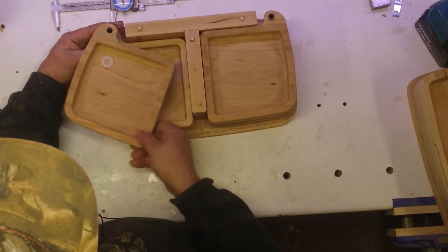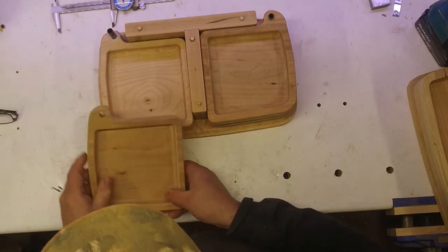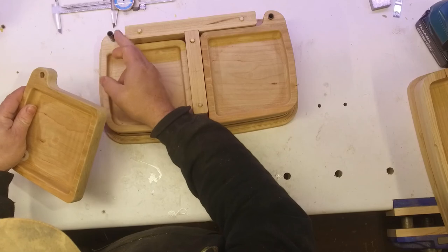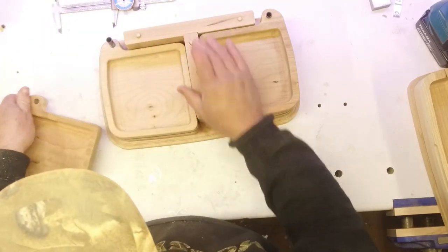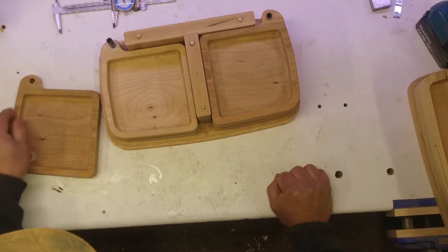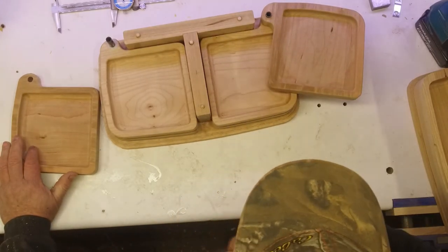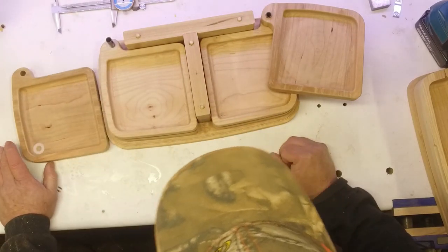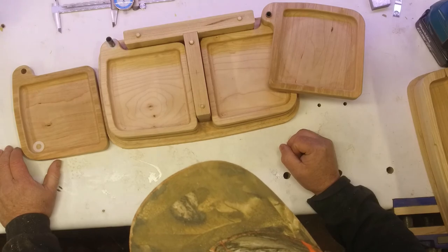I'm not going to finish and assemble everything today — it's just too cold here for shellac and everything. But as you can see, everything fits together nicely. I've got the little finger groove for the lid. I like making these — I've made three or four now, maybe this is the fifth. People like them because it's unique and different. Everything is machined up nice and tight. This hinge with the carbon fiber — when I do final assembly I might have to take a little bit out, then put a little wax on there. The carbon fiber means the wood won't swell and seize. I'll clean it up, finish it, sand it all, seal it with shellac, maybe put some poly on it. Thanks for watching — if you like what you see, please subscribe.